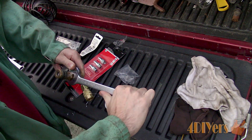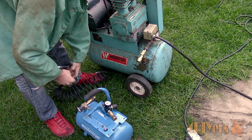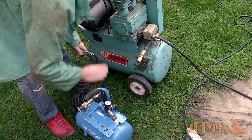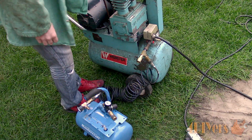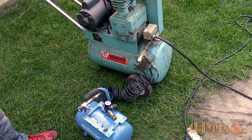Now for testing — hook up the T fitting to the air compressor. Considering there is no female fitting on the connection line between the extra tank and the air compressor, this will blow air when connected to a pressurized source. So connect this line to an empty tank first, and then to the air compressor. Starting the air compressor, allow the system to come up to pressure and monitor the gauge for a pressure drop, which would indicate a leak.